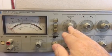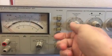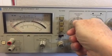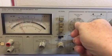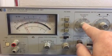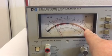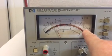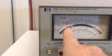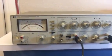Now I need to adjust the distortion to the lowest setting possible without over-ranging the meter, so I'll keep turning that down — there we go. That's as low as I can go on this meter. It's at 0.01%, which means reading the one here would be 0.01%, and so what we're measuring is 0.0025%, which is about right — what I expected. Thank you.